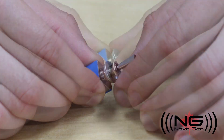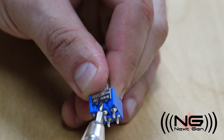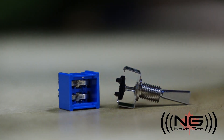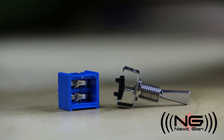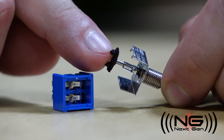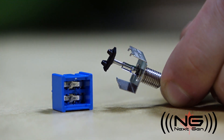We'll begin by first removing the nuts and washers. The entire bushing can be unclipped and removed to allow access to the internals of the switch. The lever, also called an actuator, is anchored inside the bushing and flips from one side to the other. Inside the actuator is a spring that depresses a pin, also called a plunger, that pushes down on the movable contacts underneath.